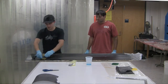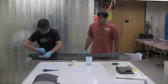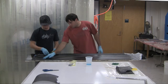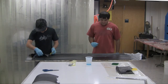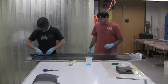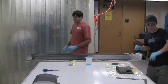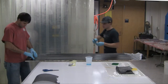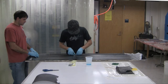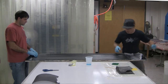You can place the Kevlar underneath the carbon fiber for the sake of good looks so you don't have to look at it or sand it. Kevlar doesn't sand very easily — you can sand the epoxy right out of the Kevlar, but you can't sand the Kevlar away. So we peel up the carbon fiber and place the Kevlar underneath. Now do one last check with the square to make sure the carbon fiber is in the right place, then a final visual check looking down the end. Looks perfect.